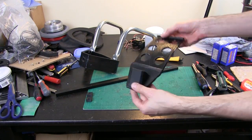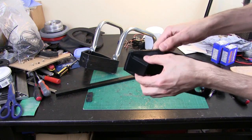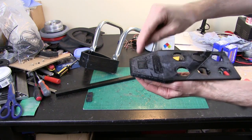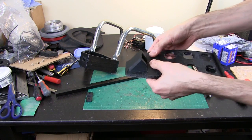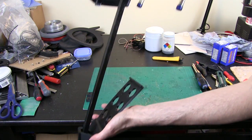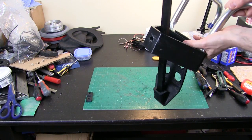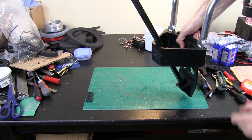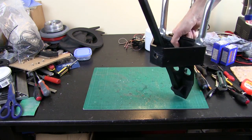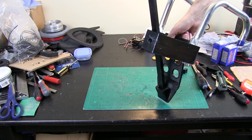Here's my printed item — the top of this is rubber and the rubber goes all the way down the back, and then I've got these ABS sections. I've got the ABS holder there for the stick, and that's actually really bonded to the rubber all the way through. The way I've done that is by having ABS that goes all the way through to the base — those two ABS patches go through the NinjaFlex which is around it, meaning it's bonded incredibly well. The plan is that the stick goes in there, this bit of NinjaFlex will be glued to the back here using that lip on top, and then this holds the head up. I can clip the stick in with a bungee which goes through that hole, meaning I can remove the stick from the shoulder brace and basically plug it all together and put the head on top when I want to wear it.